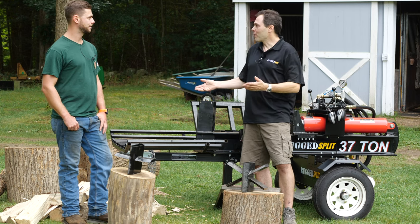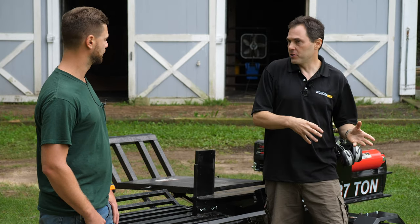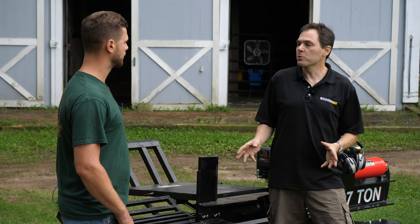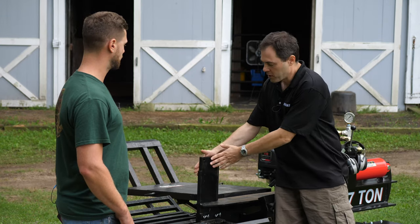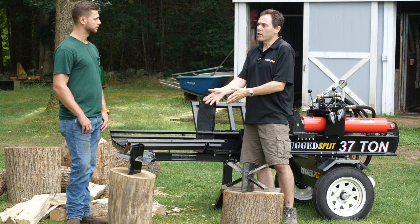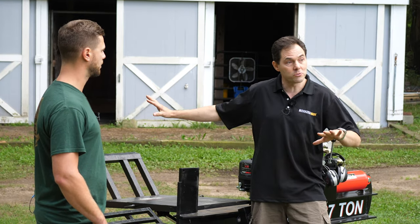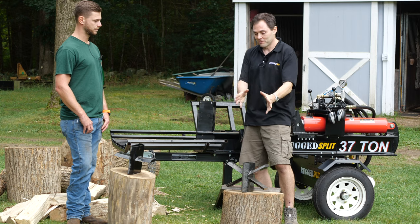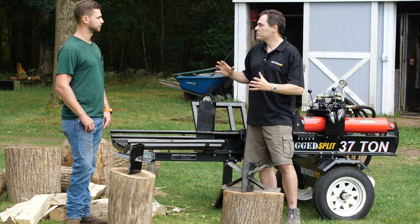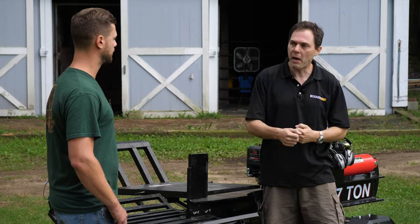Great to have you here. We've made a few other videos — hopefully our viewers will see those too. One topic we've covered before is splitting 101, how to operate your splitter. Today we wanted to dig a little deeper: if your splitter has options, you've got your straight standard blade — every splitter has at least that regardless of make or model. A lot of splitters now come with a four-way; here we've got a slip-on example for our 700 series, and our 500 series has bolt-on wings. And then we have the holy grail, the six-way blade. So when does the four-way make sense, when do you go back to the straight blade, and when can you use the six-way to get that high productivity in one pass?